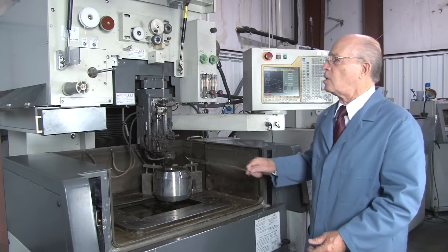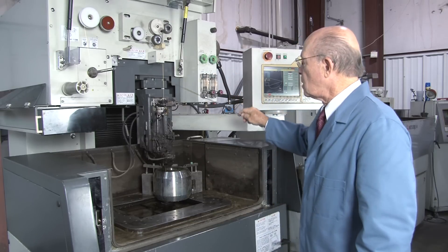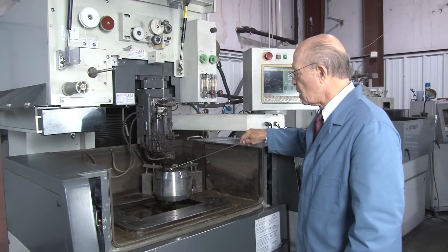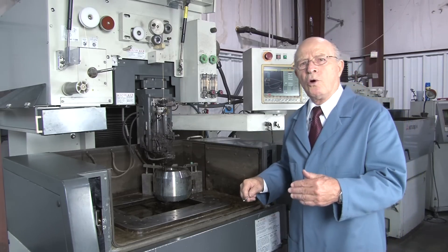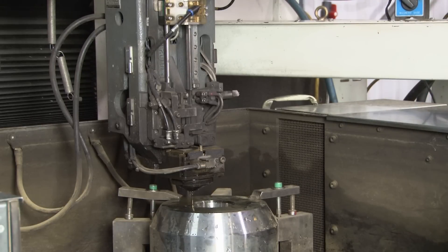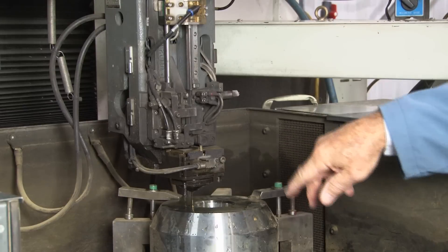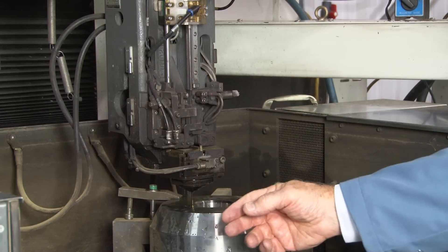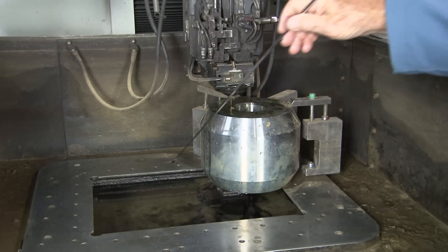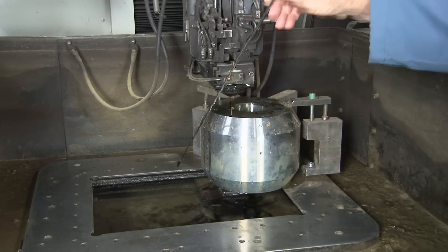This is another wire EDM machine, and here you can see the wire coming in from the back of the machine. It goes up through these rollers, comes down, and then goes through the diamond guide. Here's a part of the machine where we're cutting out a keyway — there's a keyway in here that was already cut out. This machine also has an automatic wire feed system. This will automatically cut the wire, chop it up, then the machine moves over and automatically re-threads. One advantage of this is that we can have the cavity filled with parts, and it will automatically re-thread at each section wherever we program the machine.